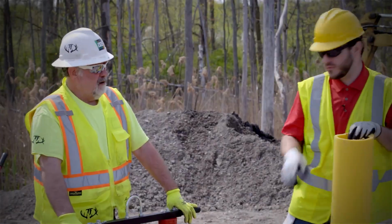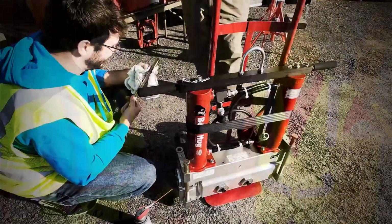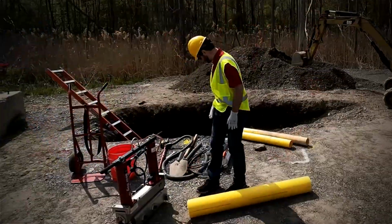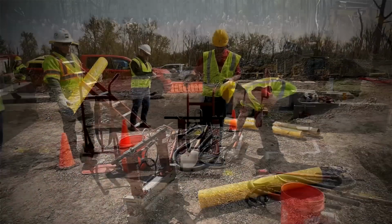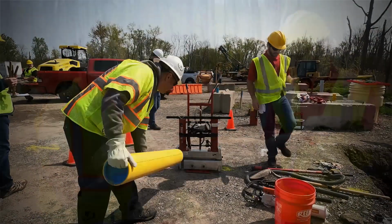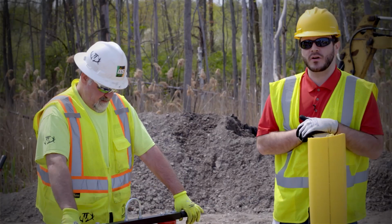And then for maintenance of the tool, just make sure all the moving parts are unblocked and free of any debris. You want to make sure that you store it in the closed position with the cylinders all the way fully retracted. And that is how you use the Bear Hug squeeze tool.